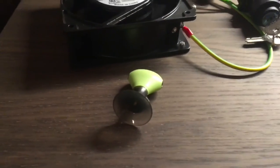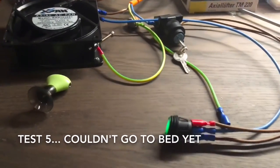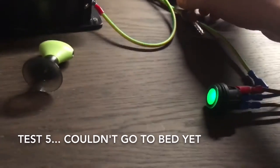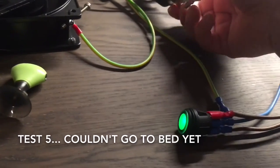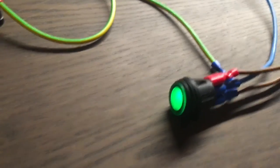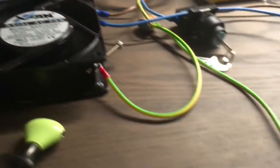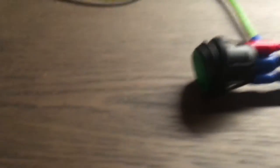You can have power with no light. That would suggest working back to front. I turn the switch off — turn it on — switch off, no light, switch bar on, no power to the fan. Switch the bad boy on and the light comes on — we've been there before. But when we turn it on for the first time the light goes off and the fan goes on. Figure that out — we've just broken the circuit to the light.